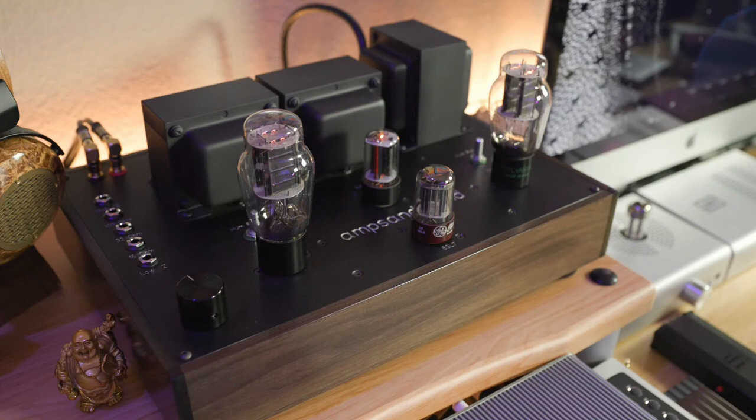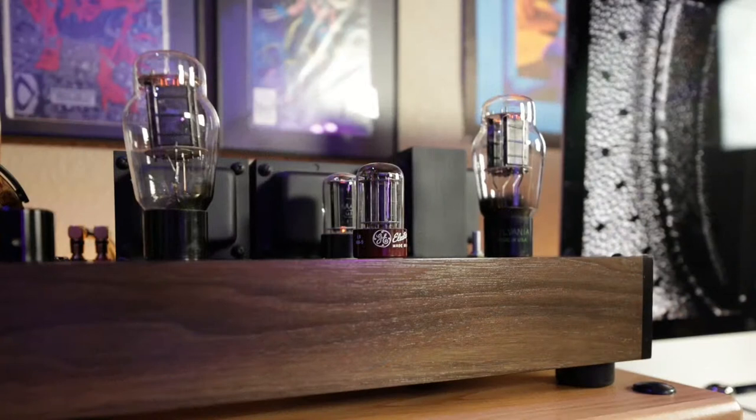One of the things to be said is, if you look at almost all of my designs, the only two that are true triodes are the Kenzie, which is Kenzie Innovation sharing the same idea, and the Rockwell. Everything else is what we call triode strapped, so it's mimicking a triode sound. When you think of old school tube sound, this is one of the more quintessential examples, because you're not modifying the tube, you're running the tube as simply and as organically as you can.